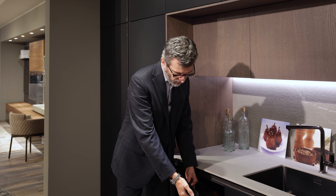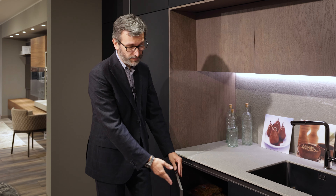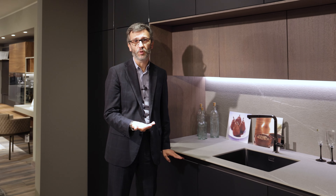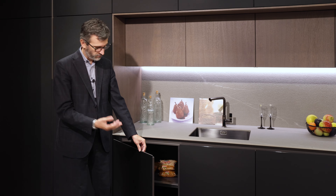In this specific version of the Plan kitchen, Plan 03, we have applied glass to the aluminium frame. This is matte glass in the color Pece, and you have all sorts of colors — more on that later. The glass here is four millimeters thick, so we have 16 millimeters perimeter plus four millimeters of glass.